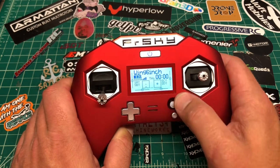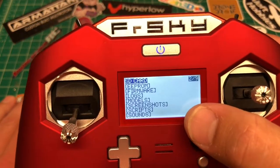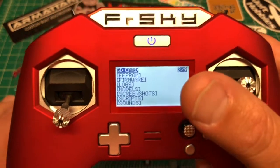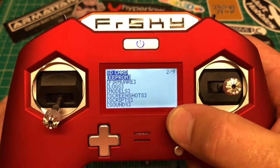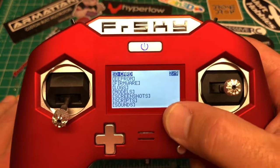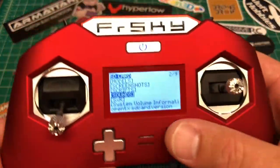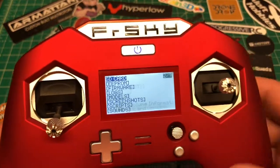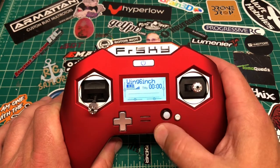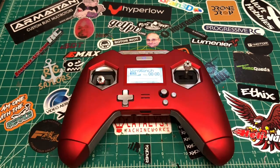The other thing to cover quickly is SD card contents. If you want sound packs, download the content from the FrSky website — I'll put a link in the description — extract it and put it on the SD card so it looks correct. The files are visible right in the radio's screen. I have the Amber sound pack. Once you get this all set up, you won't get SD card contents warnings. Also set your failsafe in the model menu.